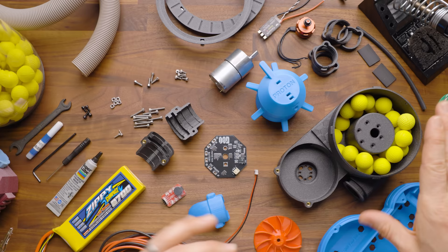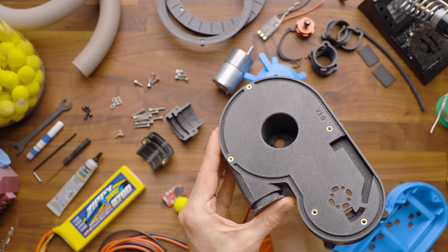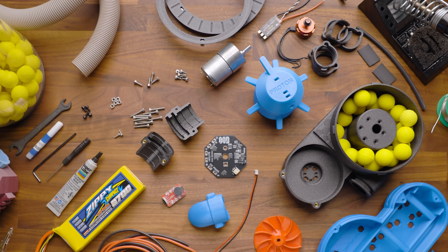Starting with hardware, the brass inserts are going to come pre-installed. One thing you're going to want to check right when you start is that you've got two brass inserts up here and that you have five more on the bottom. We pre-install these because we've got a special tool for it, a soldering iron all set up for it, and we thought it reduced the margin of any potential error for someone that hasn't done those before since we've done hundreds if not thousands of them at this point.